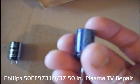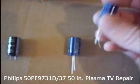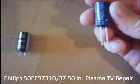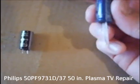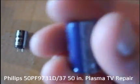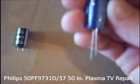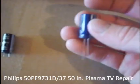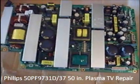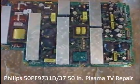One thing that's important: I do them one at a time so that you're making sure you're lining up your positive and your negative — that's very important. You can't just slap it back in. One thing you'll notice on the new capacitors is that it makes it kind of easy: the leads are different lengths. The longer lead is your positive side and the shorter one is your negative side. So I'm going to go ahead and stick these in, put the board back in — there's about eight screws that hold the board into place — and it should only take me a few more minutes, then I'll come back and let you know the result.